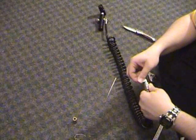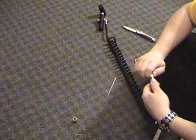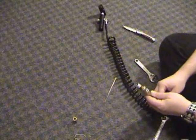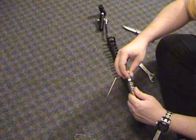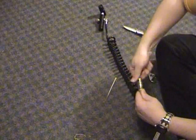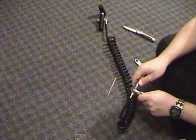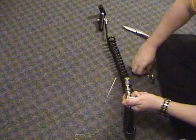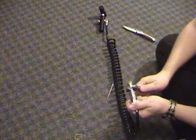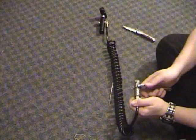Take a sharp knife and cut a small length — one, two, and a half rotations roughly. Run your fingers around the threading to smooth everything out. Try to make sure it doesn't get down inside the hole or block the hole. Put your quick disconnect female back on, hand tighten it down, then go the rest of the way with your hex wrenches. You need it very firm, but not cranked down too much.